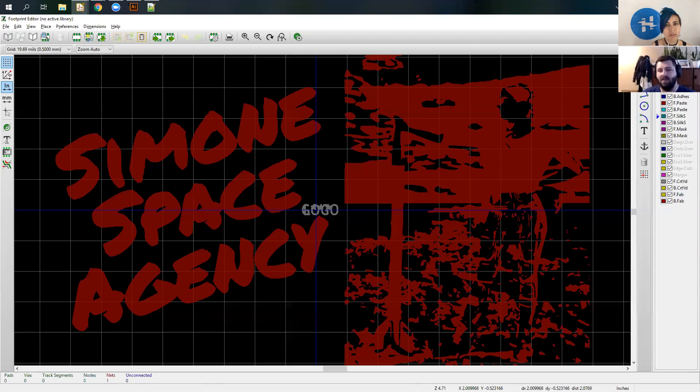If you want it on the back, you do have to flip it. If you go in the program, you can flip to the backside and it'll rotate it. For the coin I made, I just did it one time and then flipped it in the program — so it wasn't mirrored. I've also used this technique for more engineering applications, like making holes in different footprint outlines. You actually have access to the edge cut layer, so you can make odd shapes in your footprints. I've used this to make a cutout for a reverse-mount seven-segment display that I could move around with the part as I moved around my PCB.